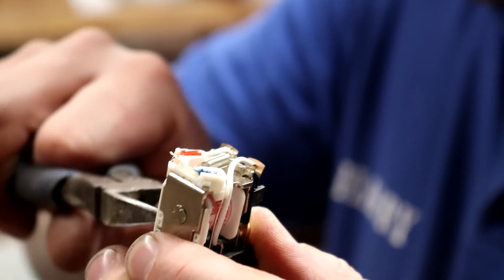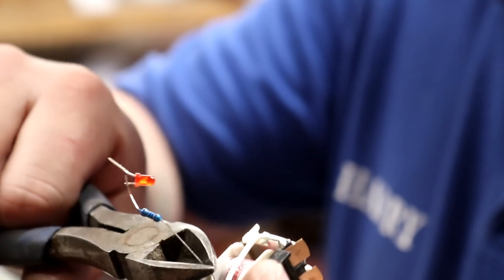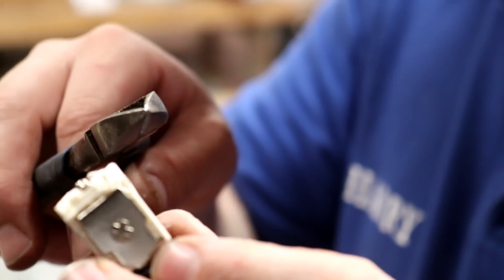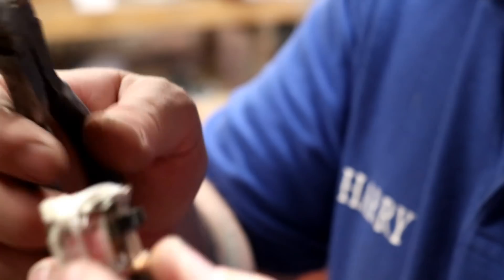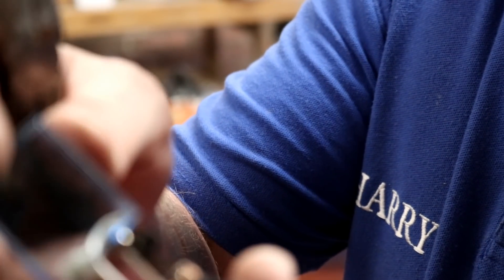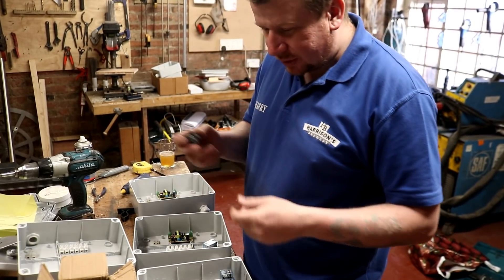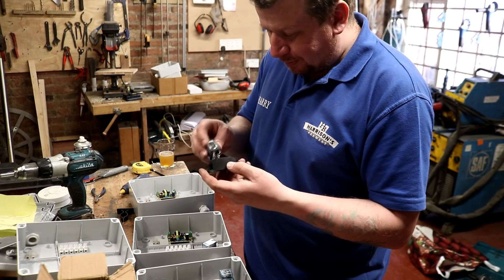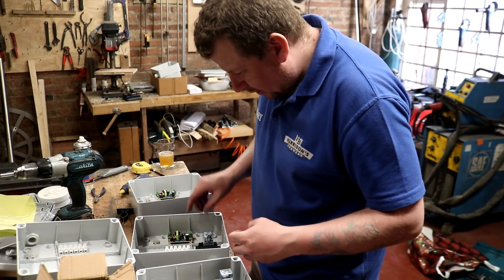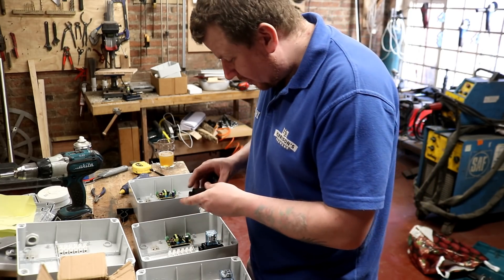What I like to do is just take the resistor and LED out - just like this - and completely remove it. So now they don't overheat and they last a considerable amount of time longer than if I hadn't removed that little LED and its current limiting resistor. We're just going to pop these together and they go in a row at the bottom of the boxes like this. I'm just going to do this for a while until Gemma arrives essentially.